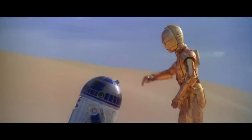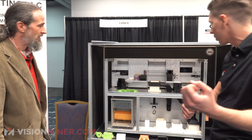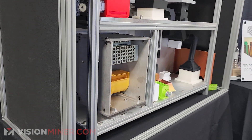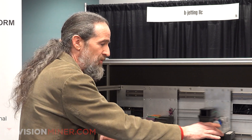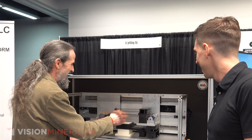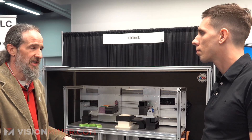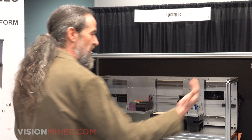Is that a Star Wars reference? No, it's because it had a 200 millimeter build box, so they called it the R2. The R stood for rapid and the 2 was for 200 millimeters. So here today you've got the Educator — give me a brief overview. It's a binder jetting platform to start with. It's got all the powder handling — you've got to put a level powder pack down, print your image with binder, which is just a term for glue. Then you add a little bit of heat between each layer. It does everything you need for a basic binder jetting system, plus it has a built-in curing oven and a built-in depowdering system so that everything fits in one small box.